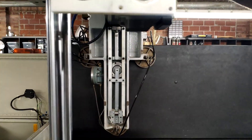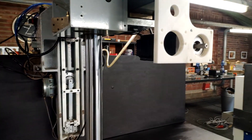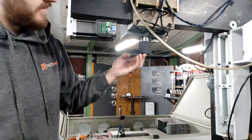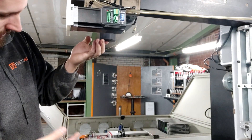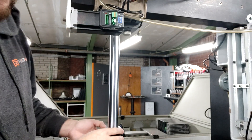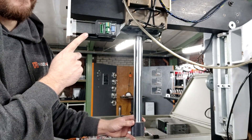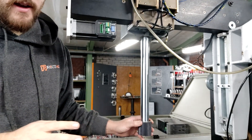The ball screw I'm pretty confident would fit, but what I really wanted to know is how much space I have left if there is an actual hot-end extruder up here. If I move this to the most upper position, I have right about 150mm of clearance from this plate. Moving all the way over, I think we'll have lots of space to get the lines run to the extruder motors and get the filament to the extrusion point. So this might be an option, but I will be testing one different CAD design, maybe give it a test print, and then settle on the actual plan.